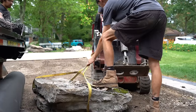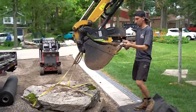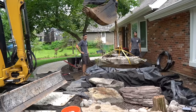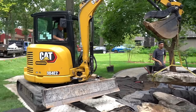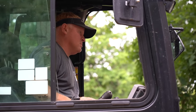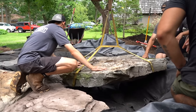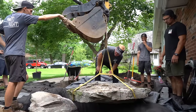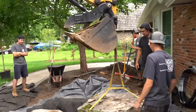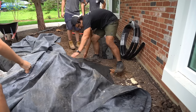We're grabbing another rock — our other frame boulder. This one has a lot of character with the moss on it and is almost always tapered, with a natural high spot tapering down to a natural low spot. It can look absolutely amazing or pretty bad if done wrong — it can take on a very man-made look if stacked incorrectly. Let the rock talk to you. Here we can tell we need to dig out a little more for it to sit just right, so we mark out where to dig. With machine-sized boulders, it's literally one rock at a time.